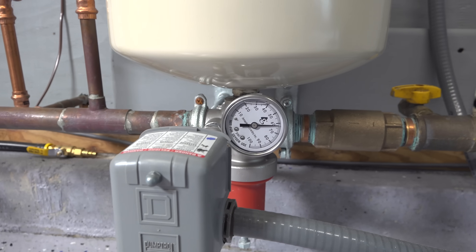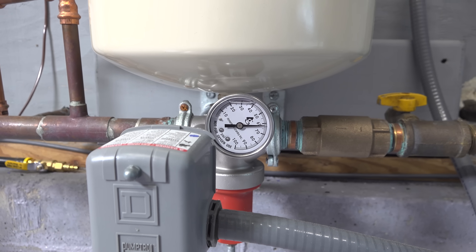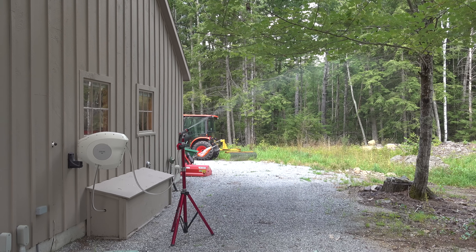This system is fully pressurized up to about 55 PSI. You can see here on the gauge that the water is live in the line, and I've got a reel just outside that I'm going to set up so we can see that the water is running the entire time I'm doing this installation. You should be able to install one of these valves in less than 10 minutes.